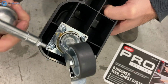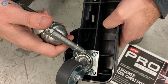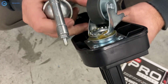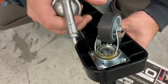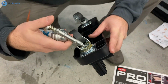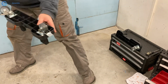And so this is not perfect, and I'm not able to get a huge amount of grease inside here to the bearings, but that is all right. I just want a little bit of grease added all the way around, and I will clean all the excess, and this lithium complex grease should work well for years probably. So that's what it looks like.